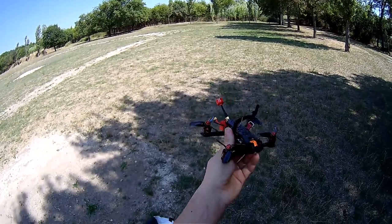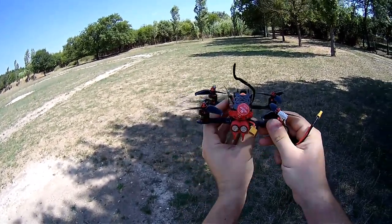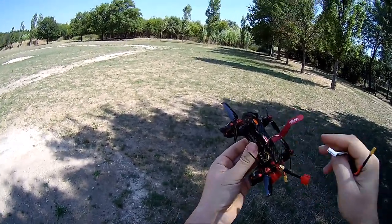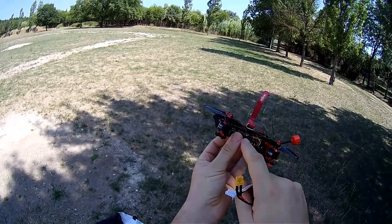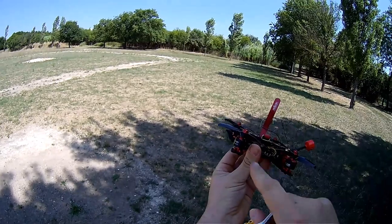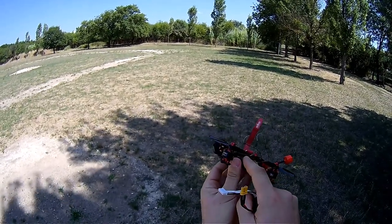And I would say the most important thing: this machine out of the box can, and probably will, suffer some yaw jitter, like this. The machine will turn like this spontaneously on left and right. It's linked to the vibration transmitted to the flight controller here via the upper carbon plate. You will have to gently unscrew, and even better unscrew the four nylon nuts at the bottom, in order to insert some little play into the gap between the flight controller and the upper carbon plate. I would say it will be even better if you can insert a piece of foam between,